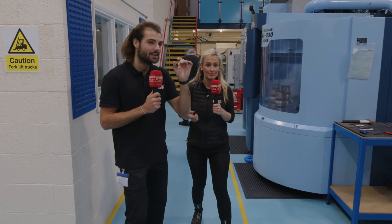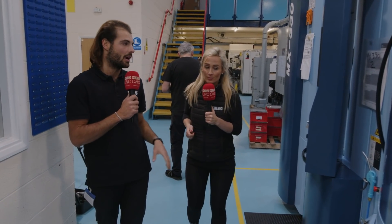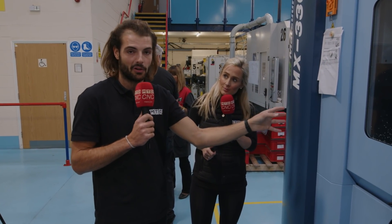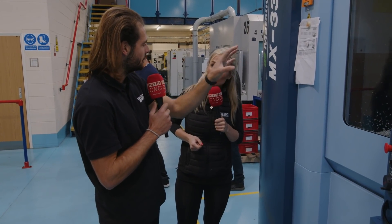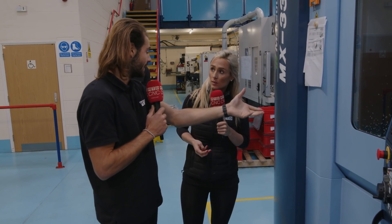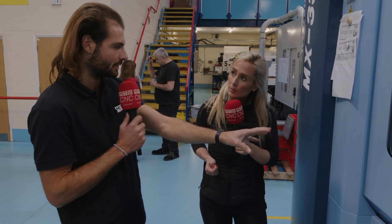Software is also really important. At R&G, because they've been able to dial in these machines so well and their operators know them so well, they're process engineers. They've designed all the processes in CAM software and post out all the programs. They also use a software called VeriCut — other softwares are available — to simulate the actual machine kinematics, so they can make sure there are going to be no machine crashes, which is obviously really important for a machine like this. The other important part of the VeriCut simulation is they get an accurate estimation of how long the cycle times are going to take.